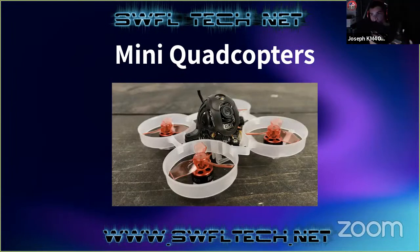I've done a long range mod on this. It's got 2 Wi-Fi antennas on there because this is 2.4 gigs, so I can use high gain Wi-Fi antennas. And these actually will direct your power along the horizon instead of doing what the stock antennas do. It's not so great for airplanes because you lose the more omnidirectional radiation pattern that it had before. But if you point one antenna flat and one antenna up, it does the same thing.